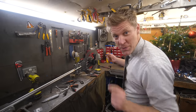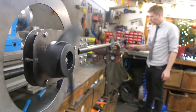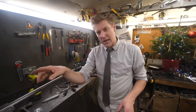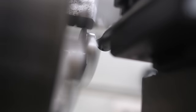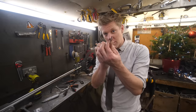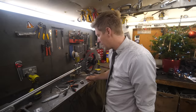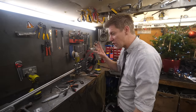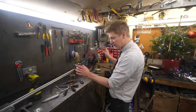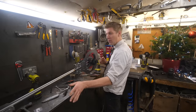That's got it all together - that was a nightmare. It's all connected up and it spins round. They both go round in the same direction, which is good. In the middle I had to shave a bit off the gears, and I ended up plasma cutting some of my own spanners out of 1.2 mil steel to get down and slot them in. The chain is tensioned via these little slots - you put it all together and pull the whole thing back and tighten it up.